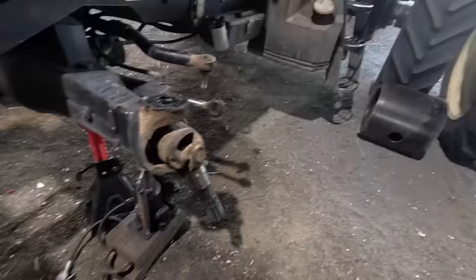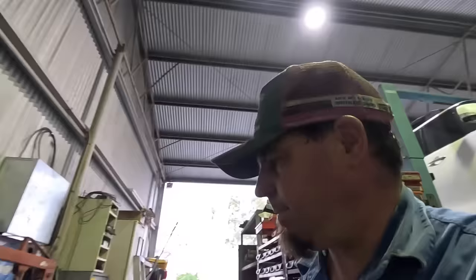Yeah. Oh guys, we've made some progress. Now it's just time for cleaning. And we've got rain happening, so that's lovely. Hopefully the cotton's getting some. It's the final drive we're doing. The problem with them is they don't have any shim adjustment for the preload on your bearings or for end float, so they're a bit loose.